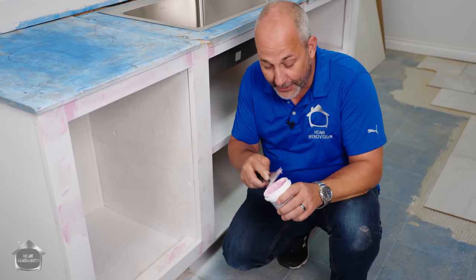We're going to use the roller and get a primer on the MDF doors. MDF needs a good primer, and there are specific water-based paint primers for this. But because I've got the oil out I might as well just finish it off. I'm going to lather it into the corners. I really should have sprayed this when I had the spray gun out, but it's only a couple of doors, so it's not a big deal. My patching is dry now, so I'm going to give everything a quick light sand and then shoot it all with the original Bin from Zinsser. If you're going to prime with an oil, prime your spots with an oil — or they will flash, meaning you'll see it through the paint.